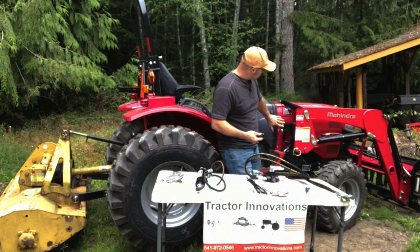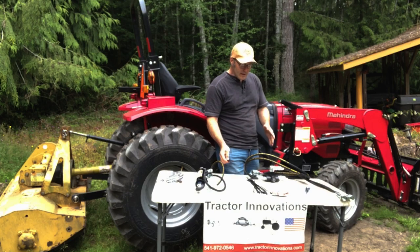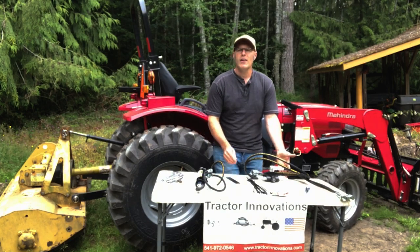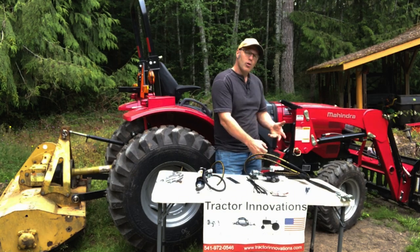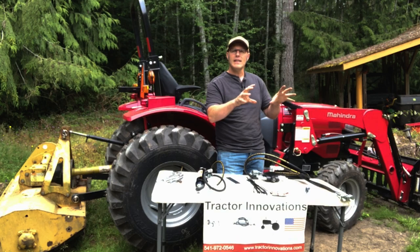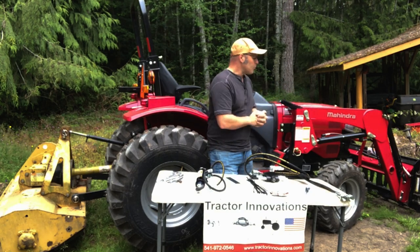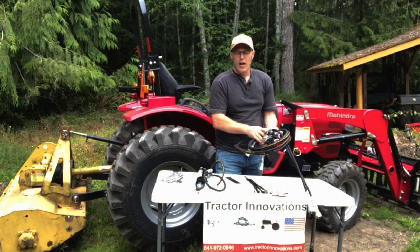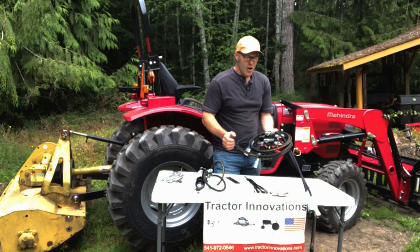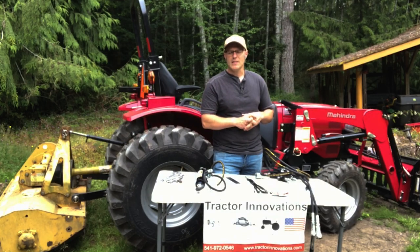This tractor has a really nice mounting spot, so we're going to be mounting a bracket and mounting the valve right here. This is a switching valve. The way this is going to operate for a grapple is we're going to install it on his dump circuit. When he pulls out on this valve, the dump circuit is going to be locked in place and right and left movement on the lever is now going to open and close the grapple. Really simple installation, really simple operation. And by avoiding all the electronics, we can use a made-in-the-U.S. valve. I buy the hoses from a company here in the U.S., made in the U.S., so as much made in the U.S. as possible. It's going to install with simple hand tools. Let's get started.